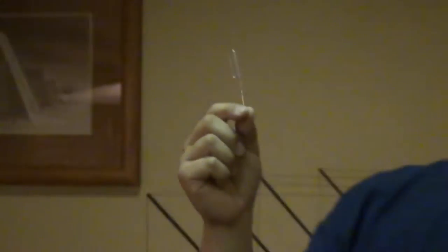Another thing you can do, and this is always a good thing to keep with you, is if you find that you're getting too strong and you take the antenna off, or even with your rubber duck on you're getting full strength everywhere, if you just put something like a paper clip in, that's going to give you just a really crappy antenna, but that's kind of the goal when you're really close, is you need to get the signal weaker so you're able to tell the difference. So it's a good thing to keep one of these with you when you find yourself in the area between too much signal and too weak signal, with an antenna and without an antenna.